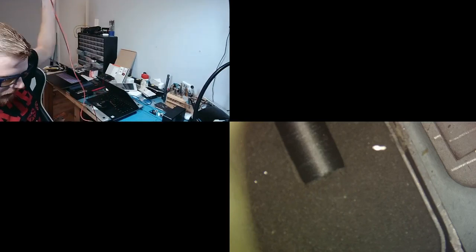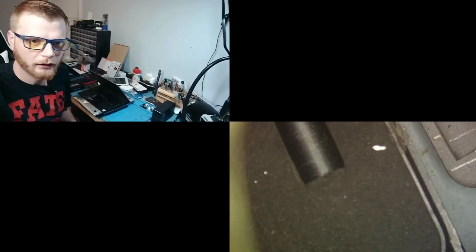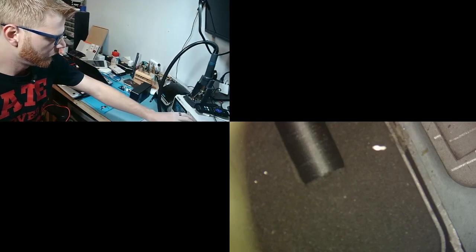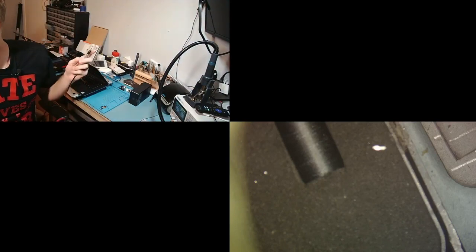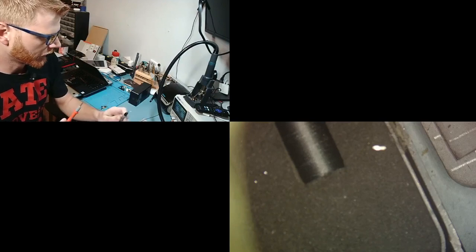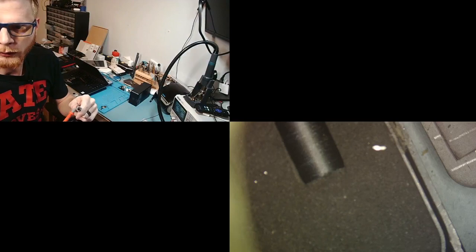All right, let's see. So now you can barely see my DC power supply over here. I'm going to turn it up to three volts would be fine, and 1.9 amps is fine. And then I'm gonna turn on that line that I'm using. All right, and now I'm gonna touch my two probes together and confirm on the DCPS that it actually showed that it was pulling current.